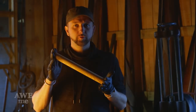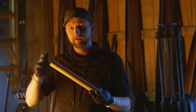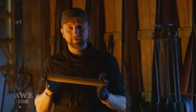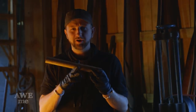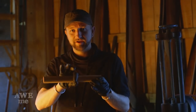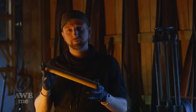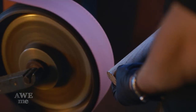It's time to move on to our handle portion. The handle of Master Yi's sword is a very long spiraled handle. It's in two parts, but I'm gonna make my job easier by leaving it one part to start with. Then I'll split it in half and make a nice spacer in between. Reason being is I want that spiral to remain real fluid through both pieces. So we're gonna leave it this length. I'm gonna go diagonal on the sanding belt and get her carved up.